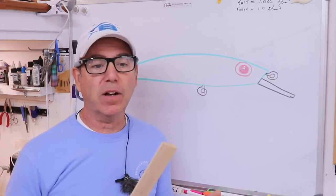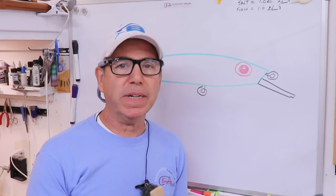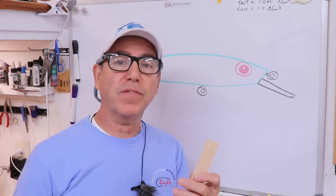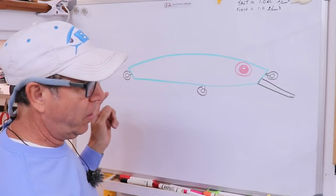Balsa has its pluses and minuses. It's easy to work, easy to get a hold of, relatively inexpensive, easy to cut, easy to drill, sands really quickly, and you can carve it. But it tends not to hold sharp edges very well. The other negative is that it's soft — you can stick your finger into it if you hold it too hard — and it won't hold a screw-in eye, so you have to make a continuous harness.